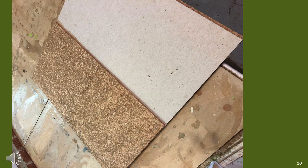Initially, my thought was to glue 2 tiles on the reverse, and when dry I would glue the other 2. I was trying some new ideas. This may be able to work, but in the end I decided to glue all the tiles in a single session, and the main reason why I think this is wise is when the tiles glue, you'll sometimes get hard glue along the edge, which makes it very hard to butt the unglued pieces up against it. So glue them all together.